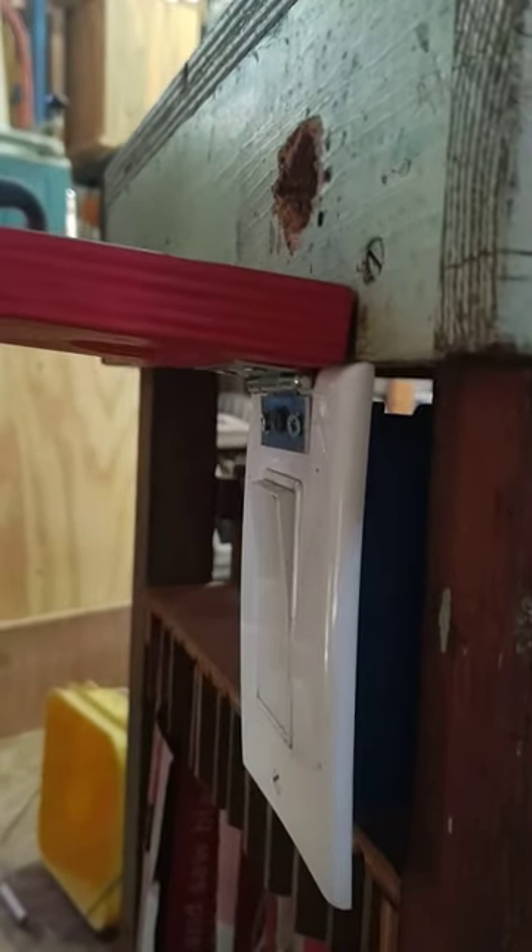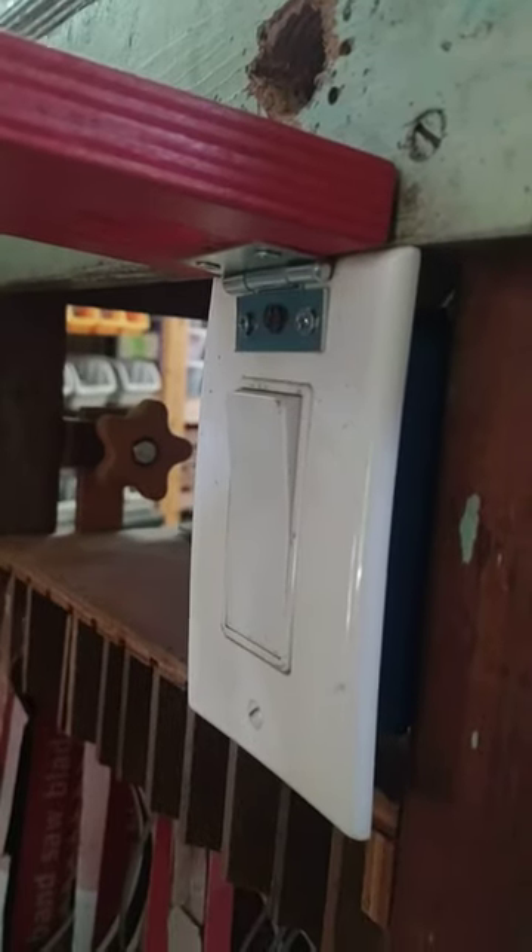With this plate, I would suggest if you use a regular plastic wall switch plate, they're kind of a hard plastic and putting screws in them they can crack pretty easy. So I'd get one of those — I think they call them unbreakable switch plate covers — and you'll be able to screw into it a lot easier.